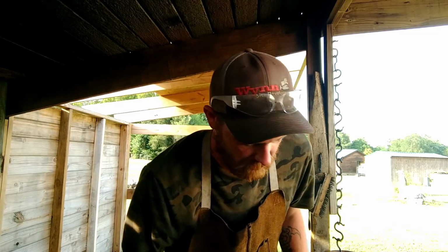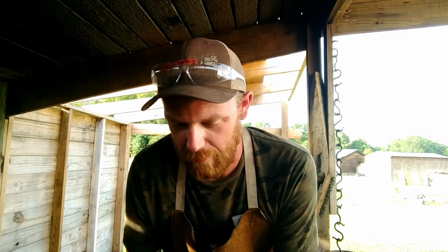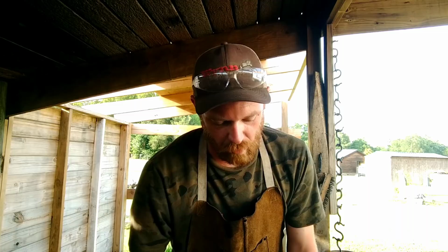Tonight we're going to go on a continuation of our tong making series. This will be part 3. We're going to make blade making tongs. We're going to set them for 1/4 inch thick by 1.5 inch stock. That way we work down some flat bar, forge some blades.